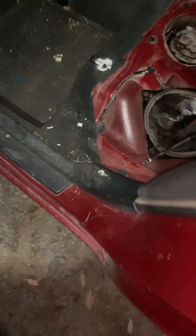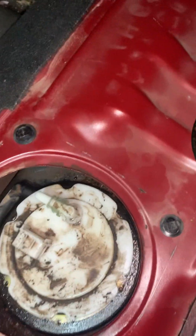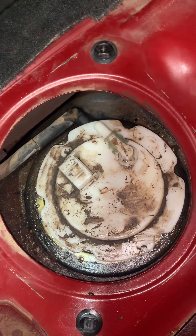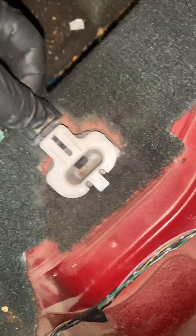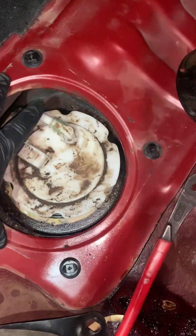What's up guys, I'm doing a fuel pump on a 2006 Nissan Altima. This one's actually pretty simple. You take off the seat first — you start with these little tabs right here. The car's a bit dirty, but you pull this out, do the same on the other side right there, take it out, and then you come to this tab — this plate sits on top here.